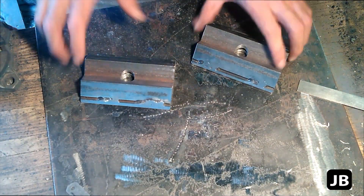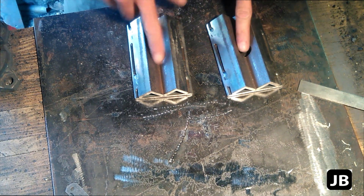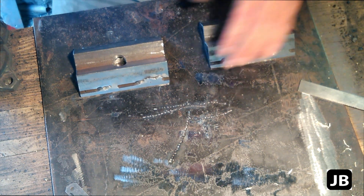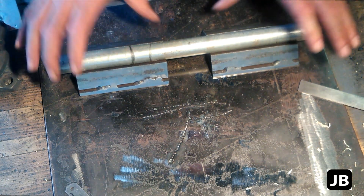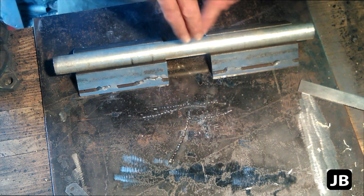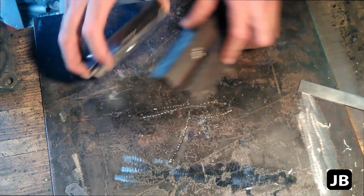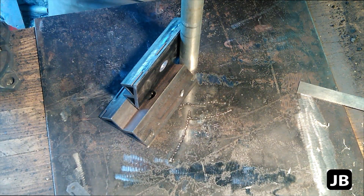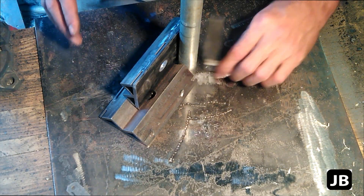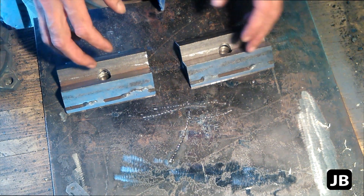So this is the finishing hole. As you can see, we've got 18mm holes drilled through, so now you can actually use it in your drill vise as well. The main idea is that if you are setting up for some other fabrication of something round, you can actually place them in between the two V-blocks, turn them around, weld whatever you want, do some piping, some notching, whatever. You can even offset and position something like that — and you get, well, that's almost on the money. This comes in very, very handy. You can also use it with square tubing, angle iron, whatever the case may be, because we didn't weld that seam on the inside.